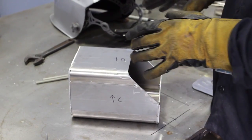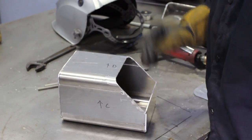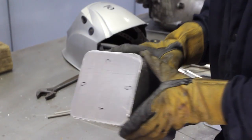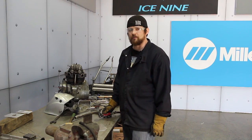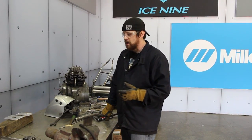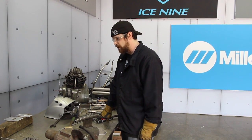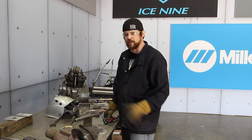When I put this together, I use a quick way to keep track of what parts go where — I letter them. It's probably easy to tell now just because I cut this angle in it, but it's C, D, A, B with the arrow pointing to the next one, so it goes in alphabetical order. On the back, because it's not a perfectly square piece, I put the letters to match up with which side it goes to. For cleaning I'm using Scotch-Brite pads. I still see people use sandpaper or sanding discs, grinding discs — you do not want to do that when you're cleaning aluminum. What happens is the carbon or carbides from the sandpaper or grinding discs end up embedding themselves in the aluminum and you get dirty welds. You can use a stainless steel wire brush or wire wheel. I like using the Scotch-Brite pads — it doesn't embed itself in the aluminum and it cleans off the oxide.